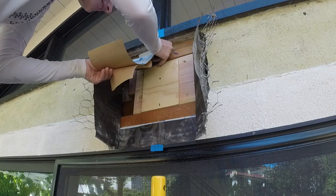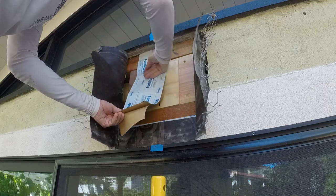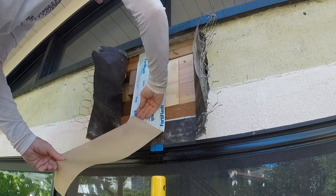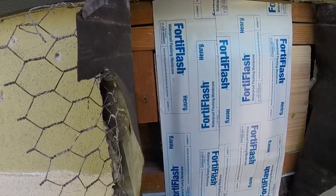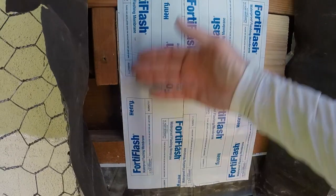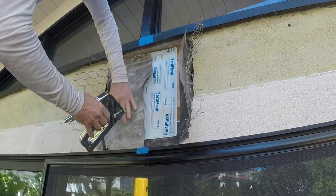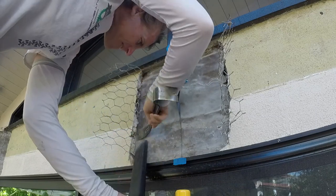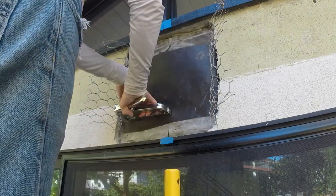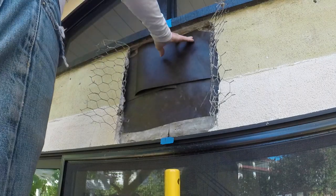When waterproofing a wall, remember upper layers overlap lower layers. I'm applying two strips of window flashing membrane first against the wood. They go from the top edge under the windowsill to about 1 inch above the sliding door below, overlapping the existing window flashing. That way, any water that drains down the flashing will stay away from the wood structure. Then I'll fold back the existing flashing and staple it in place, removing all loose pieces of stucco and debris. Then I'll add two or three more pieces of flashing paper, tucking them in between the old flashing paper and the stucco. Just remember to start with the lower ones first, overlapping a couple of inches as you move up the wall.